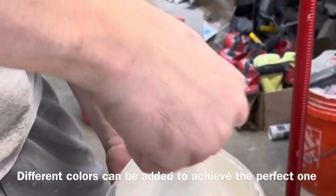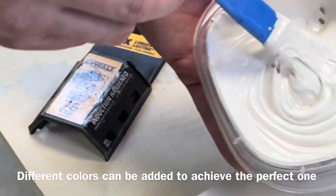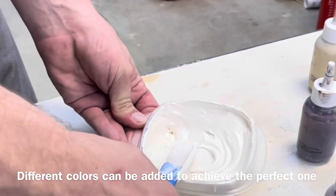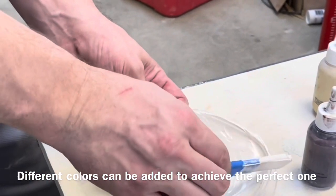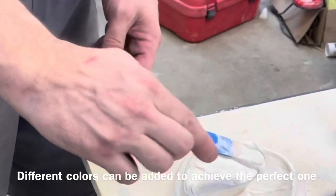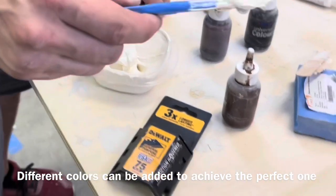And so the way that this Tenax epoxy works is, until we add the hardener to it, the part that Brent is mixing will stay good pretty much perpetually. And so when we start to add the hardener, we're going to dig out small sections, small dabs, add hardener to that, and then spread those into our countertop. And then we'll wait for that to get hard, then we'll polish it off.